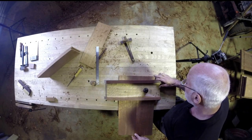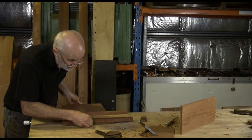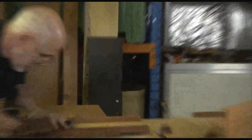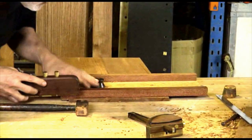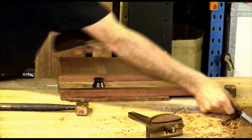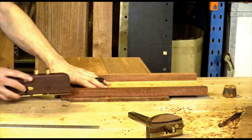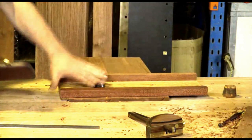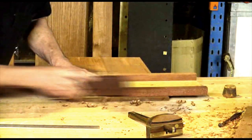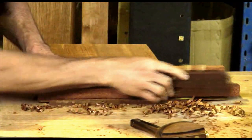I'm going to use my square, bring this in. The square is up against the two dogs and that pulls everything into alignment. We'll just have a look, make sure the dado is going to run there — pretty nice. All I did there was just make sure the dado is running down the two lines before we start cutting. Set the depth, which will be the same as what you cut on the other one. Double check — five millimetres. Because I've got my dogs holding the square that way, all I've got to do is push against my fence. I don't need to hold it with a clamp.